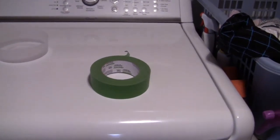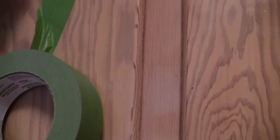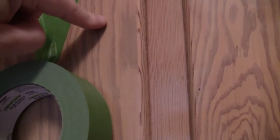This is where the green tape or blue tape comes in. You see underneath this wood it's probably pure white. What we have is a stain on it and then we have a shiny acrylic finish, an interior finish. Now if you use white tape, the adhesive on it is so strong that it could pull off the outer shiny part and the stain.